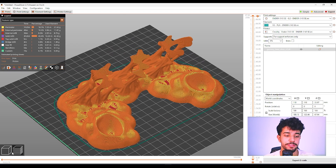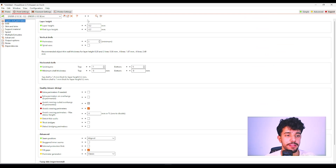Let's check out some nice printing configurations. In print settings, under layers and perimeters, let's look at layer height. We can reduce it to 0.18 millimeters. This is a really small model, and reducing the layer height helps optimize and get a really good quality print. You can reduce it to 0.18 for a fast print, or down to 0.16 millimeters for extra quality.